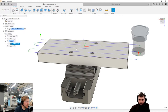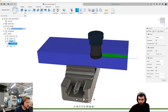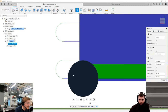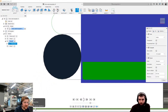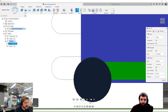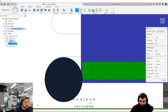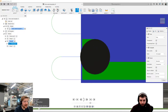When we've got our facing going across the top of our part here, if we simulate this, what we're going to see as we drag our cutter across is, let's have a quick look here, down from the top. Let's turn our whole tool path on. And you see that green portion there? You see how quickly it swings around? Do you see that one, Spence? I did. That is the linking move between those blue passes. So what that pass extension does is make sure you fully exit the material by the tool radius plus that 20%. Then it does that really quick swinging round move and then engages back at that feed rate before.